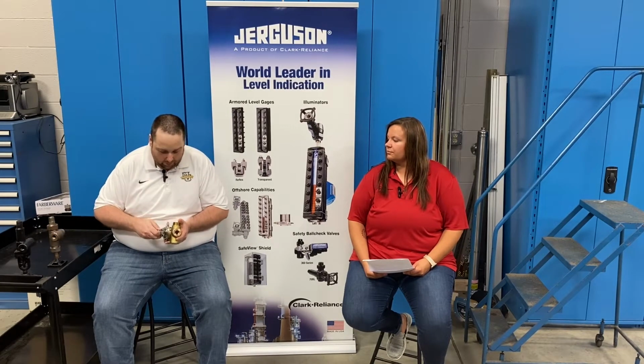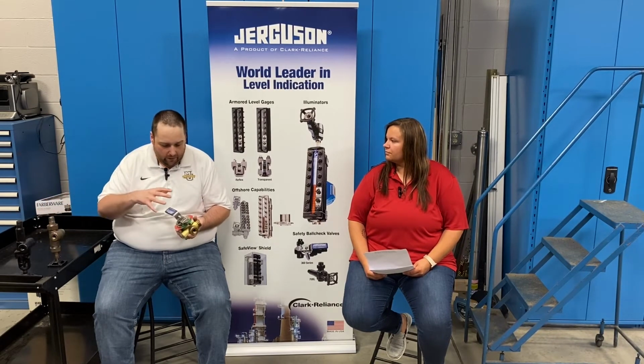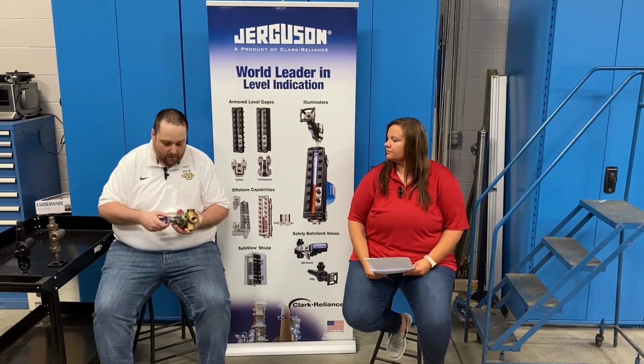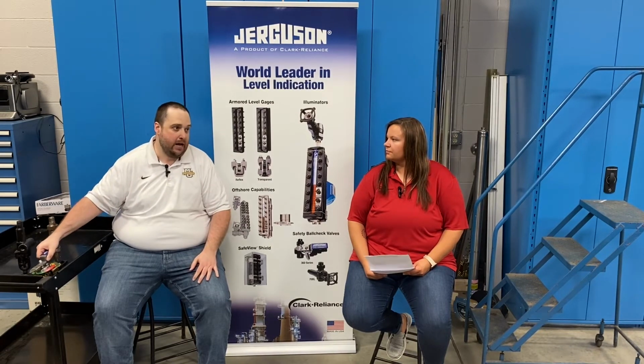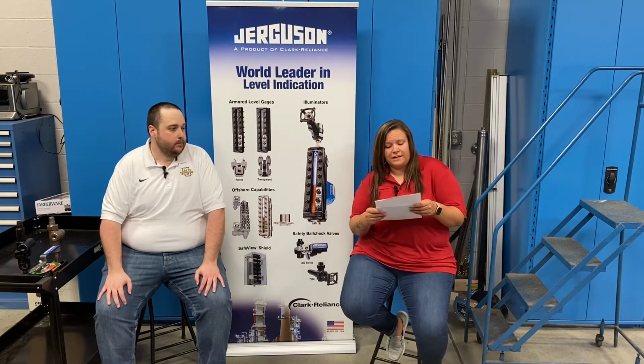But additionally, with low emissions valves, a valve has to be certified for low emissions. For these traditional style valves, I believe it's API 624, and for valves like the 360 series, it is API 641. But we have to build the valve, we have to send it out to a lab, and they have to test it and certify it. And so we did that with all these valves. We did that with graphoil packing only. Again, there's a wide range of uses. That's why we did it that way. And certainly, if there was enough customer demand for another style of packing, we could look at that. But sometimes the properties of the packing won't allow it to fit in the valve body and still be low emissions. Awesome. Well, thanks, Andy.